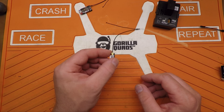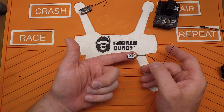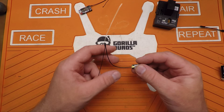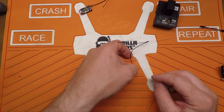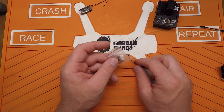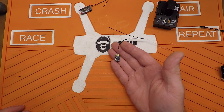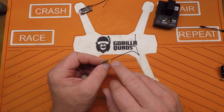Just recently they came out with the R9 Mini receiver, and this guy is teeny tiny. It's about the size — actually it's smaller than a RXSR. It's a little bit smaller than the Crossfire Nano receiver, and as far as the layout and the look, it's almost identical to the Crossfire Nano receiver except it's just a little bit smaller and it's made by FrSky. It doesn't come with any pin headers attached, but it does come with pin headers and a connector if you want to go that route. For us mini quad guys though, direct solder — that's the way to do it. The other nice thing about this one is it does support F-port, which is basically your signal wire and your telemetry wire all in one, so your connections to the quad are just power, ground, and your F-port wire. And it also has a regular IPEX-90 connector.